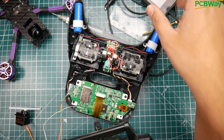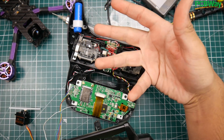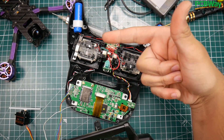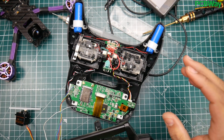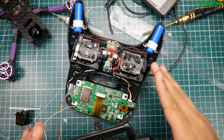This mod will just need an Arduino and some kind of a step-up — a pretty significant step-up, actually — because to enable the R9M and the TBS Crossfire you're going to need a little over 5 volts. So we'll probably have to put some kind of external battery for the module.